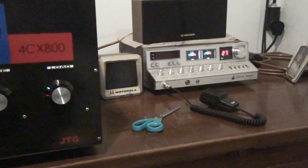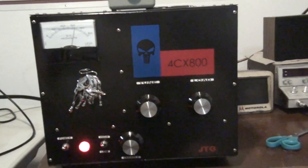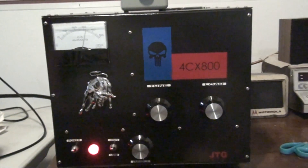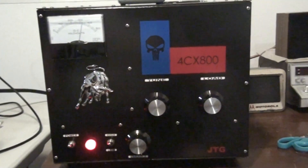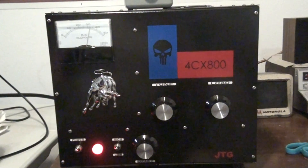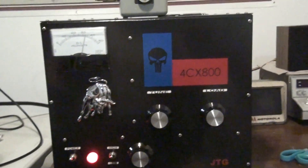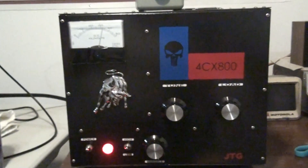I've got my Cobra 1000 hooked up and it does about 10 watts average. I think this amp will be set up for about 10 and a half, 11 watts average, so we're going to see close to the right output. I've talked about it on these low drive tubes before. The tube in this amp is referred to as a tetrode. In layman's terms, ours is a low drive tube. Triodes are high drive. Tetrodes are traditionally low drive. When Grinder builds these amps, he sets them up for a specific output and just uses average power to set them up.